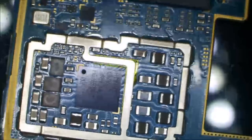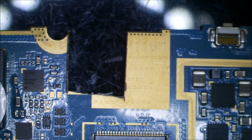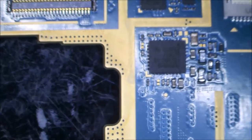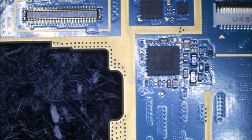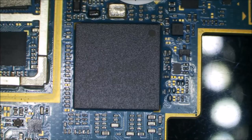In my opinion, if you're trying to recover this plated gold using a method that relies on dissolving away the base metal under the gold, you'd be pretty much wasting your time - the plating is just too thin on these boards. There's probably going to be one or two more of these videos coming along relatively soon. One viewer requested I have a look at the plating thickness on the bottom of pinless processors like the Pentium 4, and I'm quite interested to try that. If you guys have any other ideas for things that would be interesting, please post them in the comments and if I can get my hands on the e-waste I'm very happy to give it a try.